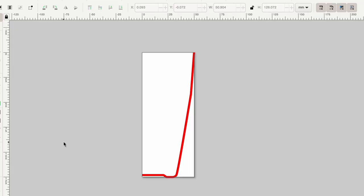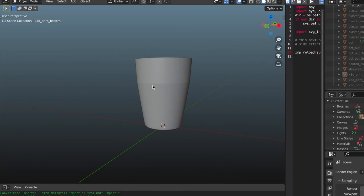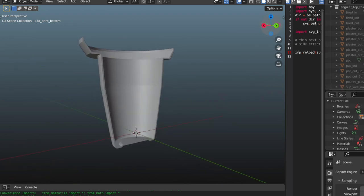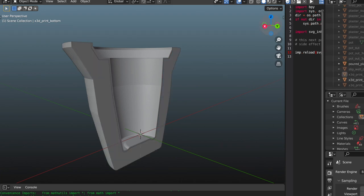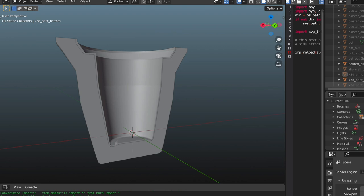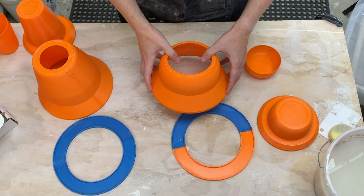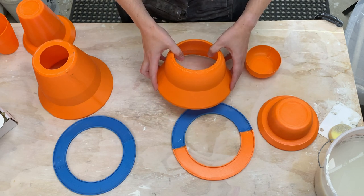Same thing with the other form — we started with the sketch and jumping straight into 3D. Here is the form extruded, sliced in half. Here's the inner print from last time, and from there we project out the plaster. We surround that with the outside shell and the cap — and there is our other mold. Just like before, all these pieces get saved as STL files and we can go ahead and print them out. Since this is all done in 3D software, I can actually calculate the volume of plaster I need, and then it does the math.